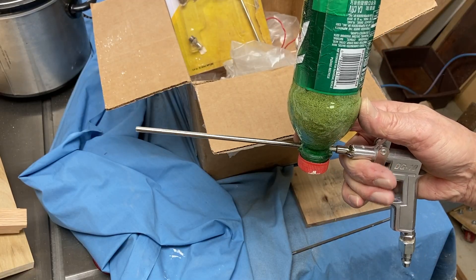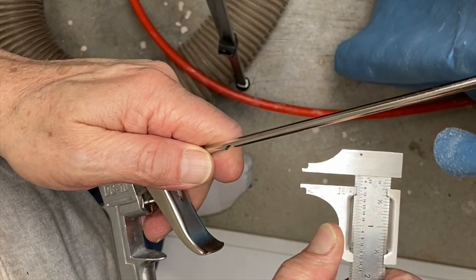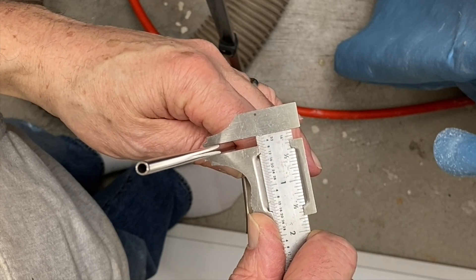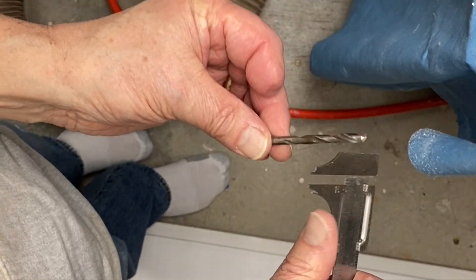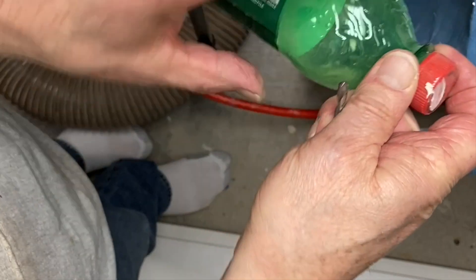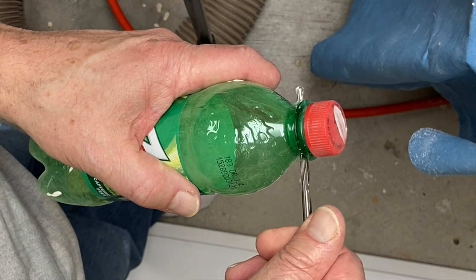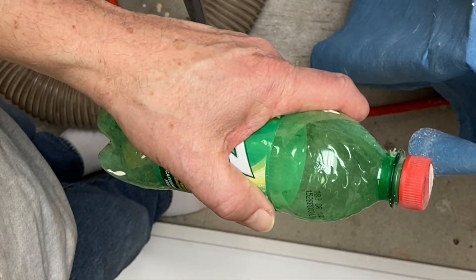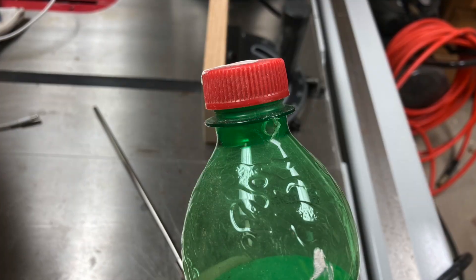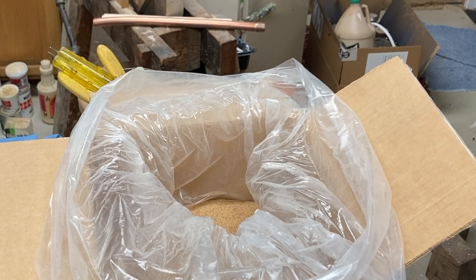It works, just as I say, surprisingly well. Here's a closer look at how I filed that tube. I wanted to make sure the hole was tight — that tube measures three-sixteenths of an inch in diameter and I happened to have a three-sixteenth inch drill bit. When I drilled the hole in the plastic bottle it was a super tight fit; it fits very tightly over the tube. I don't seem to have anything spilling out, no leaking, no whistling — it just seems to work fine. Here's a close-up of that hole I drilled.